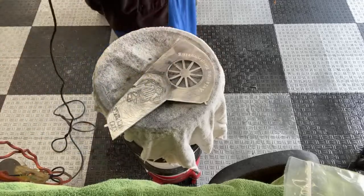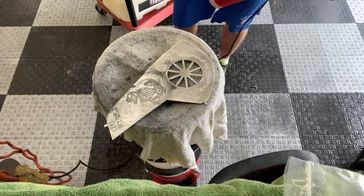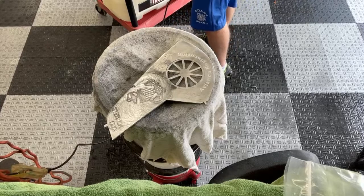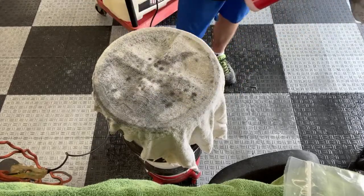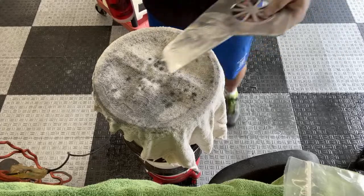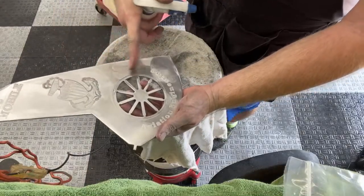You see, I'm just knocking down all those sanding marks from the 500 grit that we just used. I'm trying to get it at a nice uniform 1,000 grit. It's a pretty simple process. It's just, like I said, time consuming, especially in the beginning when you're trying to get all those scratches out. And you can see how much shinier it gets as we go down.